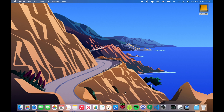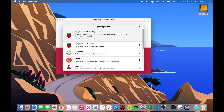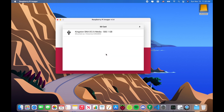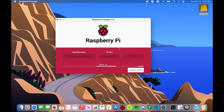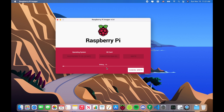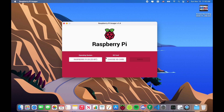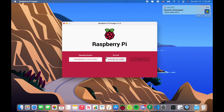After you install the Raspberry Pi Imager, open it up. Go to Choose OS and select Raspberry Pi OS 32-bit. Then choose your storage — in my case it's the hard drive. Click Write, and it's going to ask for your password. Type it in and hit OK. It should start flashing. Once it says it has successfully been written to the hard drive, click Continue. Then take the drive off your computer, plug it into the Pi, and boot it up.